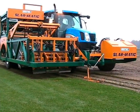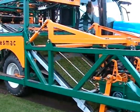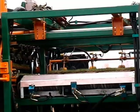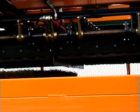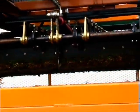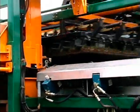Its simplistic, uncompromising design creates and provides the turf grower with the means to harvest more efficiently and cost-effectively. The Slabmatic is available in two models that offer the choice to cut three rows of 16-inch slabs or two rows of 24-inch slabs, both having the option to cut slabs 24 or 48 inches long. The Slabmatic harvests a total of 48 inches wide in a single pass, making it the most productive and efficient one-man side-mounted automatic slab harvester on the market today.